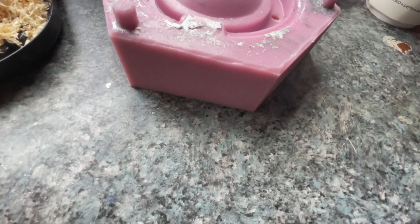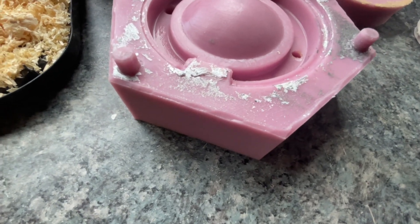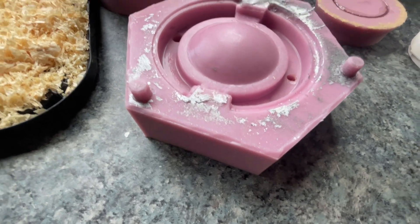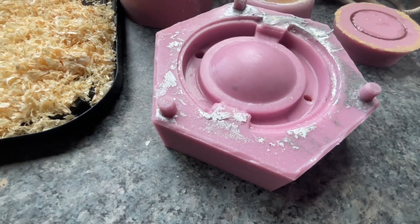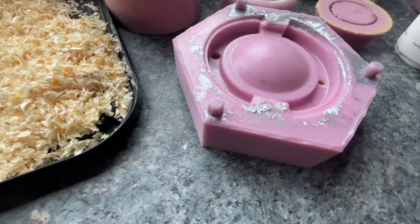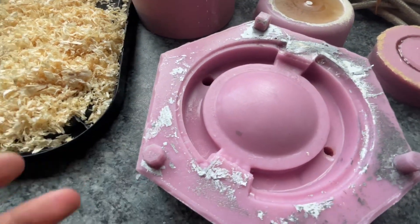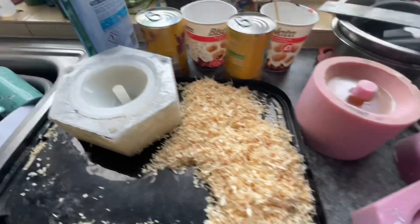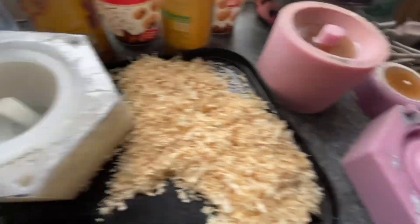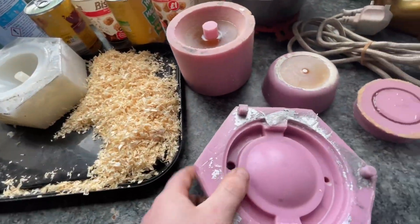Hello everyone, I'm back. Still working on the Imperials, but I've given one a go. I did it on a slow pour — basically not a lot of catalyst, otherwise it would have cracked. It's still warm and needs to go into a tap to cool off. I've made my very first casting of a plunger that's solid resin.